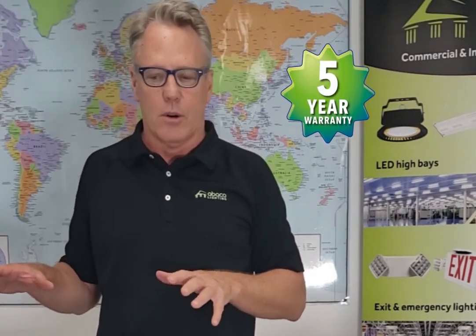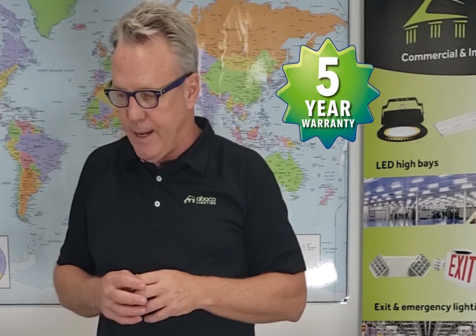By the way, these units are rated for 122,000 hours. All of our replacement fixtures carry a 5-year warranty, and they're super efficient. These units are operating typically around 140 lumens per watt, which is almost twice as efficient as fluorescent and probably 3 times as efficient as metal halide and high pressure sodium.